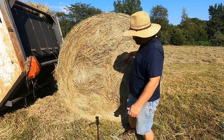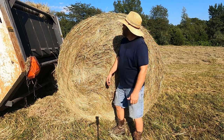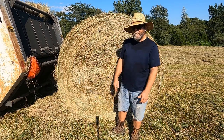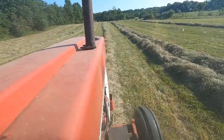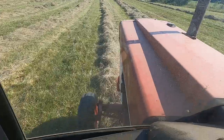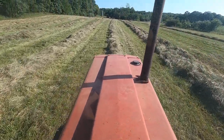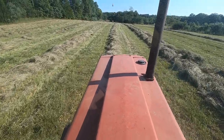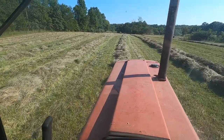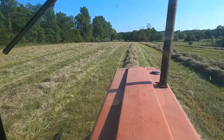This is the star pattern I was talking about on these open chamber balers. It makes a six-by-six bale. You can see it makes a pretty tall bale. I try to put the inside of the tire to the inside of the windrow and weave back and forth with very little movement. That's how I try to keep my bale uniform shaped. And that's my buzzer that I have to ignore because it's not right.